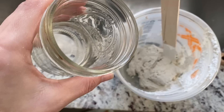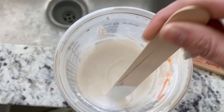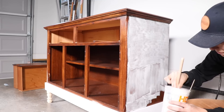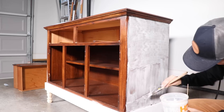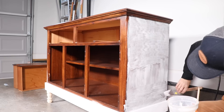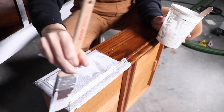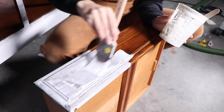Here I'm mixing up some water with some wood filler — this is Dixie Mud, but you could use any type. I'm going to paint this on to fill my grain because this is an oak piece with a very strong grain that you'd still see through the paint. I'm just pushing wood filler in and painting it all over to fill in that grain. I learned this technique by watching Danny from Just Paint It by Danny. She has lots of amazing tips to make your furniture look beautiful — you should be following her. She just launched a YouTube channel too, so go check out Danny.